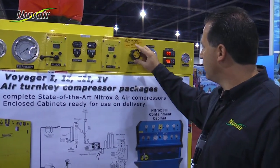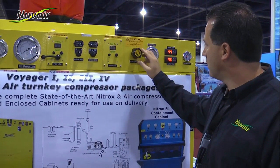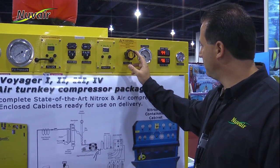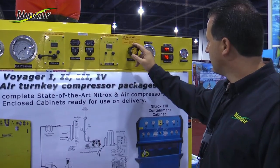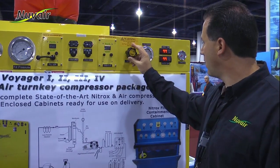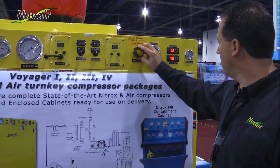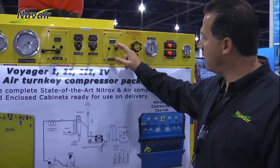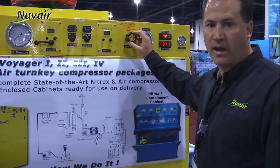To change your percentage, you just turn your knob clockwise to increase your percentage. As I come up, it's coming up to 100 psi, about 110 psi, and now we're up to 34 percent. If I turn it up a little bit higher to 140 psi, I'll come up to 40 percent. Our heater temp is still warming up, so the machine is going to vary a little bit — it may go over 40 percent slightly. Always stay under 40 percent, because otherwise everything would have to be oxygen clean.